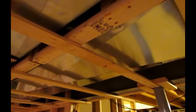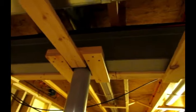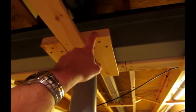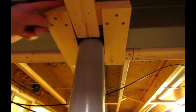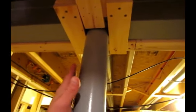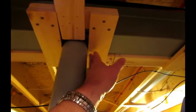This was a little bit of an interesting conundrum where on these support pieces coming across the bottom on 16s, this one just happened to line up right across this steel support pole. The center of it would have been right just outside the edge here. So what I did is I built a little wooden bracket, tied it off to my far ladder on both sides with a piece running across, and tied off my support right into the middle. This actually gives me a nice top plate type of area where, when I box in this beam on all sides, I have a place I can build right up to and tie off right across the top after I box it in.